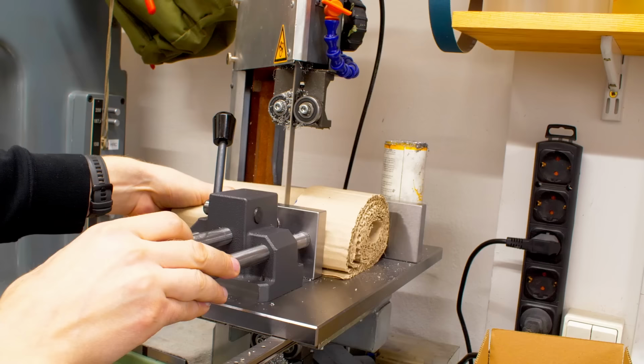Of course, people always ask, oh, Stefan, when do you get a wire EDM? I won't. Even if it's not a good friend doing the work for you, wire EDM hours are not that expensive, and a wire EDM machine is a lot of stuff. It's the machine, the wire, the filters, the deionized water. It's a complete set of work holding that has to be non-corrosive. It's a lot of stuff. That's why wire EDM shops exist. So let's pack it up.